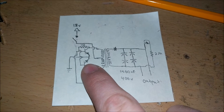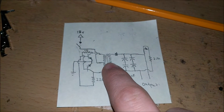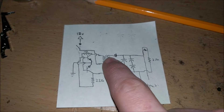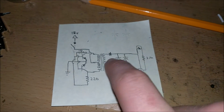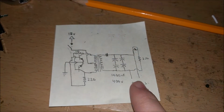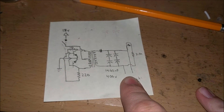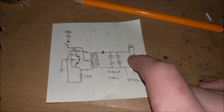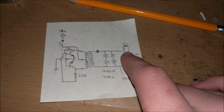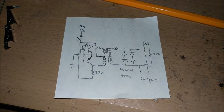So this is the circuit for my capacitor bank — this being the inverter that supplies this transformer with alternating current. And then we have a rectifier diode which charges the capacitor bank. Now after the capacitor bank is charged, it can be released on these two output pins into whatever you're using. The level meter is used with a small analog meter and a 2 megaohm resistor. So this is the circuit.